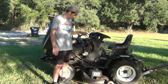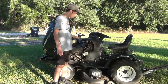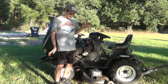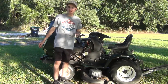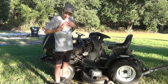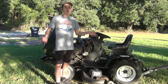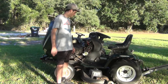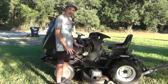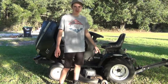It's a three-blade setup. One issue I've had with this deck is the belt system — it does like to shred and destroy belts. Partly because one of the pulleys locked up one time, and the last time I just didn't put it on right — both were operator error. But there was also one time where it just shredded a belt out of nowhere, and I didn't know what the problem was. That's something I'm still working out, but with the belts I've got on it now, we've been doing alright.